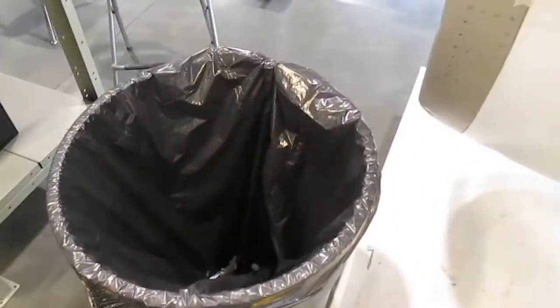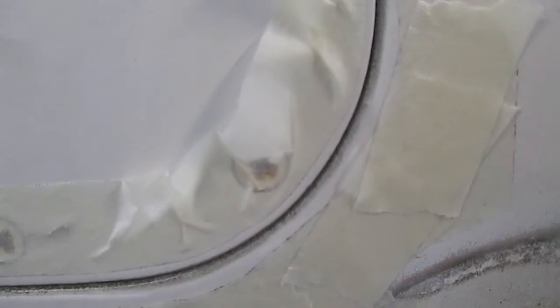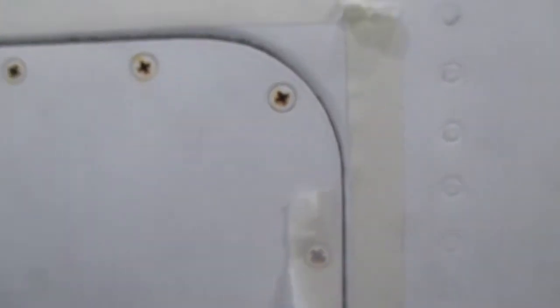What I'm going to do this morning is show you the basics of taping and sealing. You can see I've already pre-taped a bit of the area. Notice how the tape is a little ways back from the edge — it's not right tight against the edge, it's always back just a little bit so that we get better surface contact at the edge.